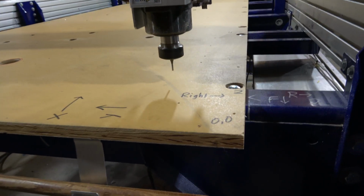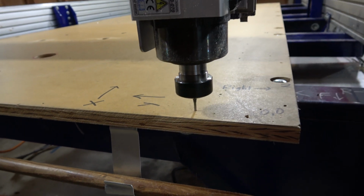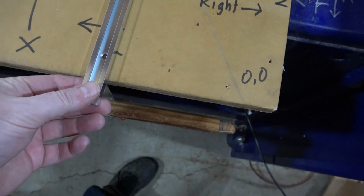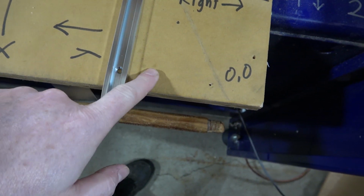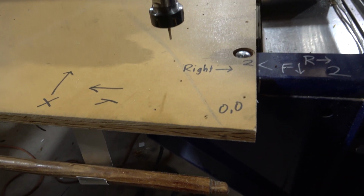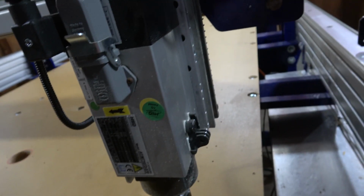So it's doing a surface Z, so it's considering the top of the plywood to be, what was that? Yeah, we had some issues with the bit depth, but that's okay. I'm just looking for the mark. So we see the holes that we made and line the T-track up, 4 inch on center. Yeah, looks bang on. Oh my gosh, I think I figured out what's wrong. It wasn't how I put the bit in. I reached the lower Z limit. Oops.